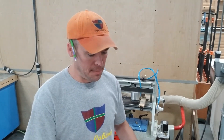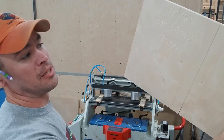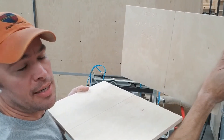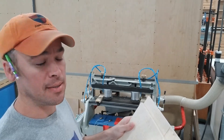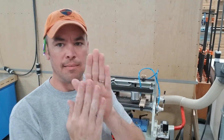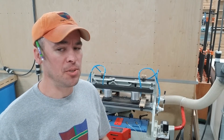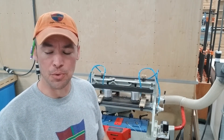So what I did was make a pair of setup boards on the CNC with letters scratched in with a V-tool. This one says 'back setup board' and this one says 'front setup board.' They're both 432 millimeters long, but the lines in each one are offset by 12.5 millimeters, which is half of the 25mm interval. You want your parts offset that little bit — that's how you line up your pins and tails. I reached 432 millimeters to get the bottom joint where I wanted it, centered with the groove for the drawer bottom.